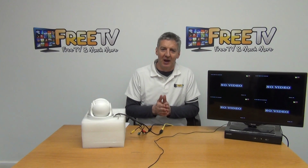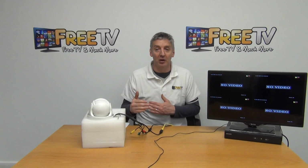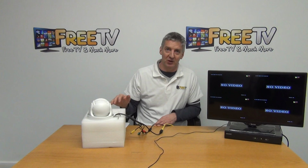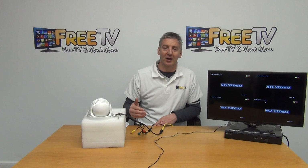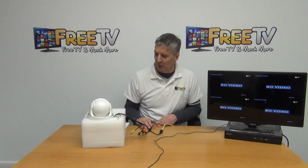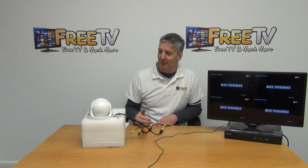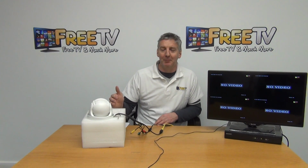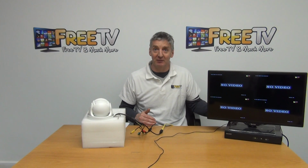How we went through it is just through the browser bar, and I noted on the local area network, it's given in the literature, but the default IP address will be 192.168.1.188. Okay, so we go in there, and I think it was settings, system, and user manager. What I did there is I changed the default admin password to be the same as the password that the DVR had itself.